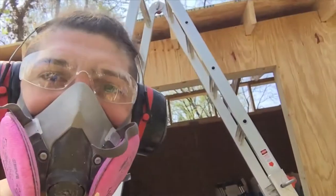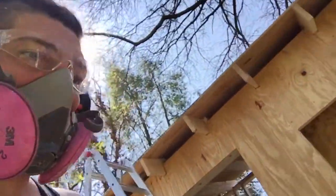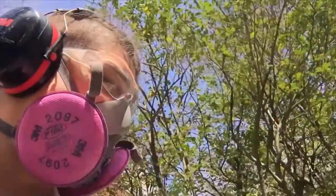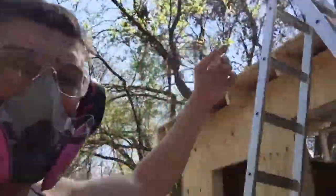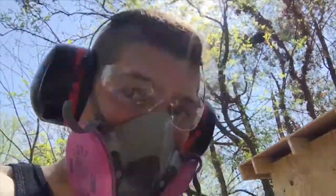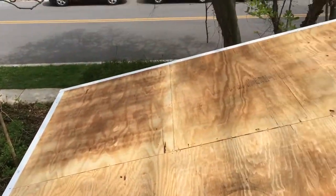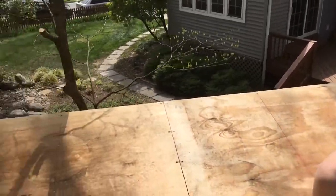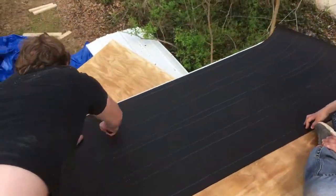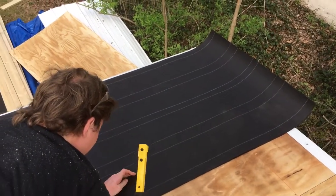Roof done yesterday. Today we're gonna button up the back side — you can see we still got some spots there that need plywood. We get some plywood in on the sides, at which point we can put the house wrap on. We're gonna put the drip edges up on the roof, then felt paper, starter shingles, roof it all. Drip edges installed on the sides and bottom edge — top one will go on after the shingles to protect that corner and keep water out. Doubling up the first course of felt paper, not tar paper — felt paper — because we've got way more than I need anyway, so why not.